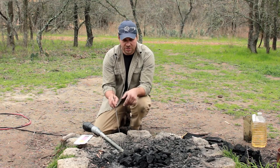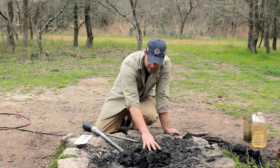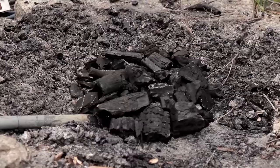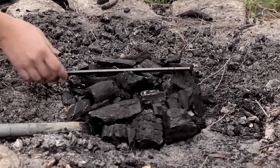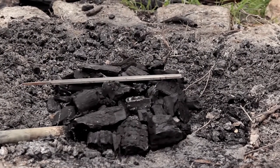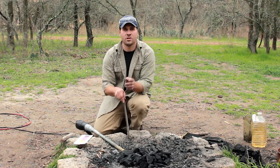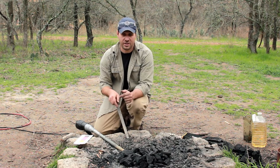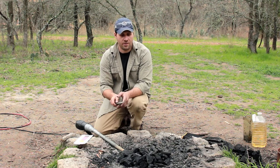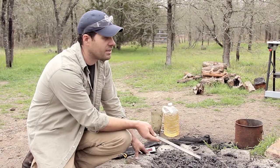We're going to use a similar system where we've dug out a little pit with charcoal in it, and we're going to use this hairdryer to stoke it. Get the steel in there and get it heated up. Once you get it up to temperature, turn off the stoking and just let it burn out and go cold on its own. The real key is that it has to cool really, really slowly. Get it up to about 1500 degrees using the same colors we talked about before, then stop stoking the fire and let it go out naturally.